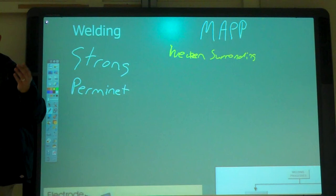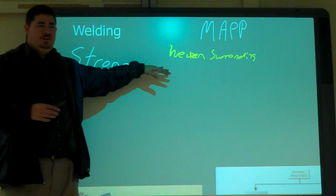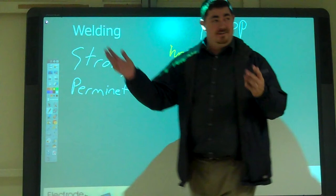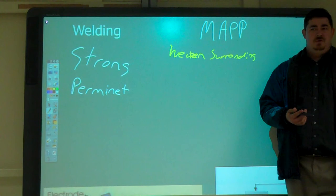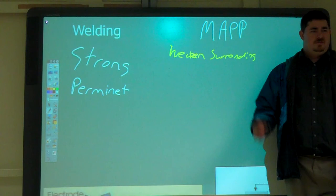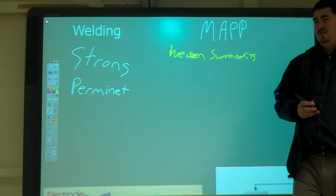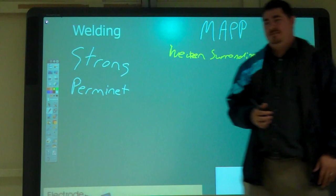Anything that's heat treated has already been carefully gone through heating and cooling cycles. If you weld on it, you destroy that heat treatment, basically. You kind of reset it to what it was when it came out of the foundry to begin with. So you can lose any of the strength that was there, or it'll crack because of the stress that's built up or put onto it by other things. In that case with the 18-wheeler, there's a lot of load on that, so when you weld on it, you weaken it, and that causes the cracks to happen. So how would you even fix it without welding anything on it? Then it's time to do an adhesive or bolt or something like that. Do a bigger channel metal.